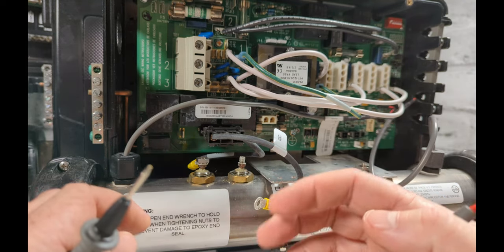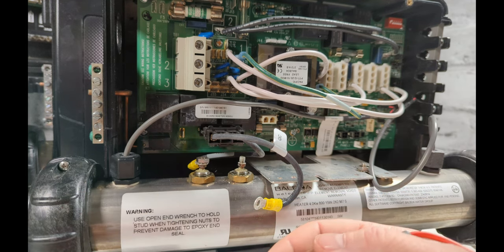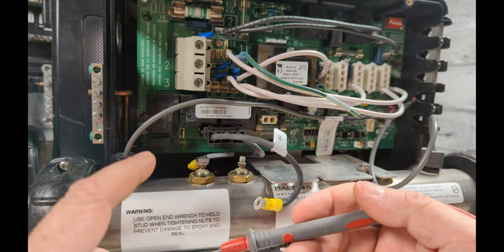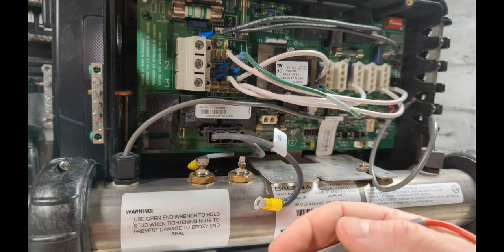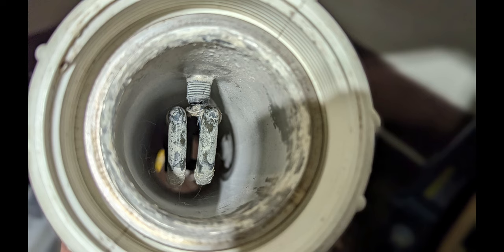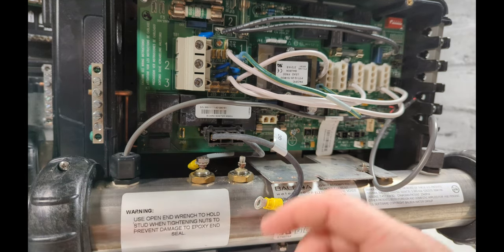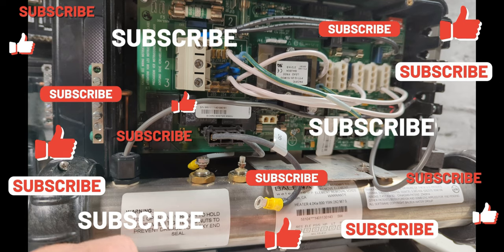If you've tested everything and still can't figure out why it's not heating — or if it's tripping the breaker, that's a different issue you can narrow down. But if it stays on with no heat and you have good amps, good voltage, good continuity, and good ohms, and it's either not heating fast enough or only reaching a certain temperature, you can pull out the heater element and check if it's coated with calcium, which can cause an issue. Normally you'll get an error code because the sensors get covered too. If you test everything and still can't figure it out, it could be a board issue. If you have any questions, just comment below and we'll see if we can work it out.